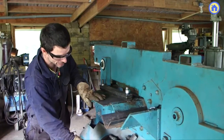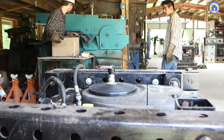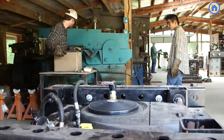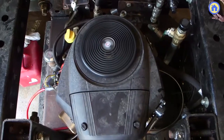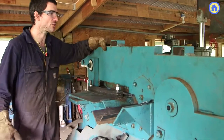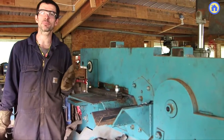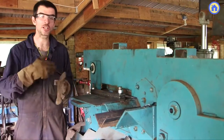It's hydraulically operated from one of our power cubes. Very large force using a big cylinder that moves up and down. There's leverage that gets multiplied, so you're actually pushing down with about 120 tons at the blade, which means a heavy-duty machine, about 3 inches thick of metal on the body itself. The workhorse of any preparatory fabrication where you're cutting out parts.